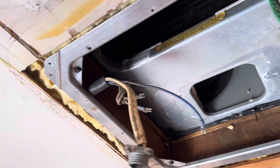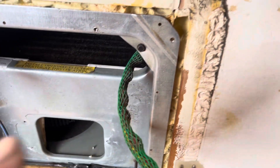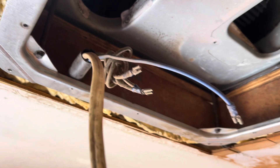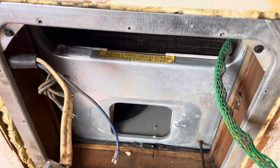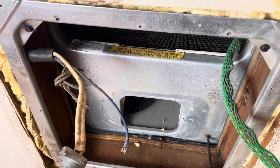With that interior piece out of the way, there are four screws — one in each corner — that actually hold this bottom plate to the top unit. This wiring is attached to the top unit and comes through the frame of Goliath. So we've got to take out those four screws, this support bracket will come out, and at that point the rooftop AC fixture will be loose. Then we can go up top and just pick it up and take it off.